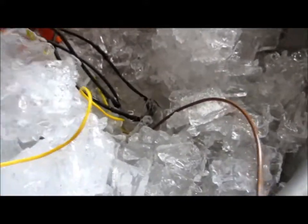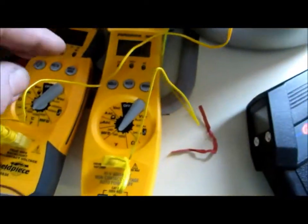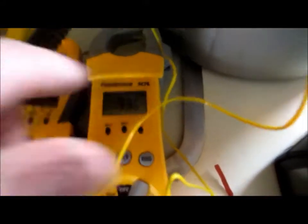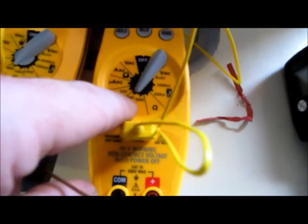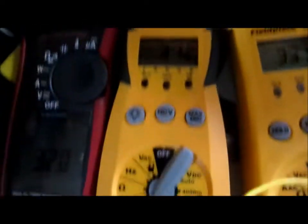I've got them all set up here with all my measuring devices in the ice bath. There's ice, water in the bottom, and they're all submerged. Now we're going by these thermistors — they might be off a little bit, that's why I'm doing this test, to see how accurate they are and whether I can trust these readings in the field. The Fieldpiece SC76 — a very common meter used by many techs on YouTube — is on the temperature setting reading 33.1 degrees. The Fieldpiece 36 is at 31.2.